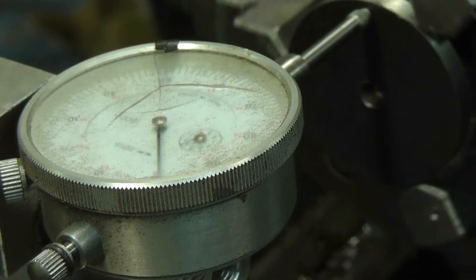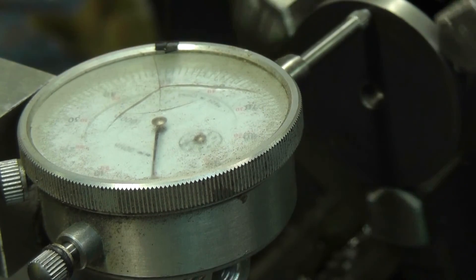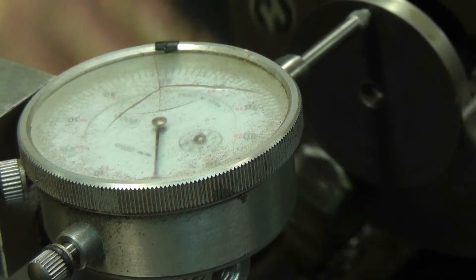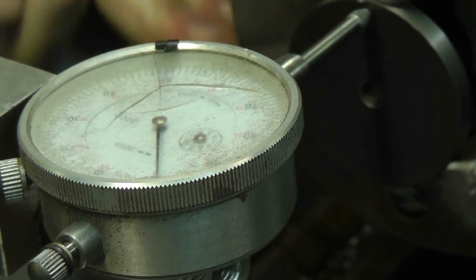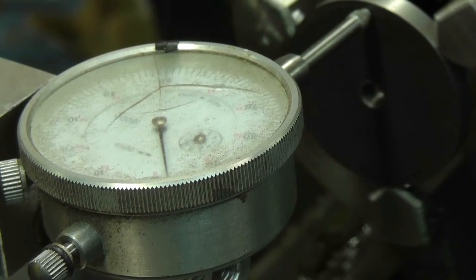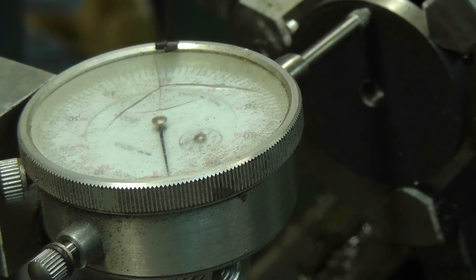From what I'm seeing, it goes from zero to about minus two thousandths of an inch. That's not too bad — that's a piece of rough scaly stock, so I don't think it's too unreasonable. We've got it bumped within certainly like two thousandths of an inch of true. I think that's a pretty effective way of aligning something.